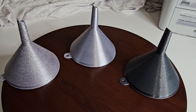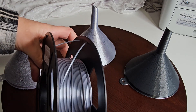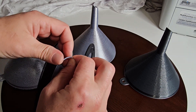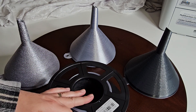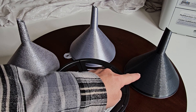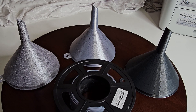So that's why I think people should have one of these, because I was under the impression that the filament I had was perfect — nothing wrong with it. When you look at it, there is nothing to indicate there's anything wrong, but let's have a look — if I bend it, is it going to break? It kind of does. Look how easy that breaks — you shouldn't be able to just break it off that easily. So I'm going to warm that all up, put it in the machine for a bit, and that's going to give you a better result.